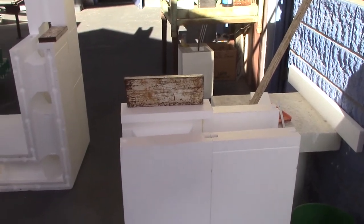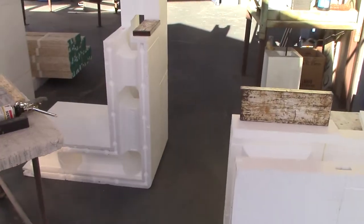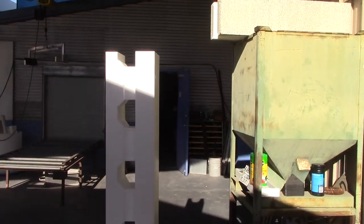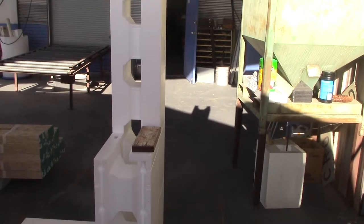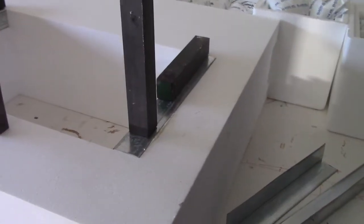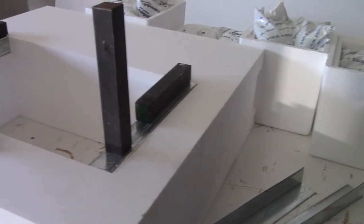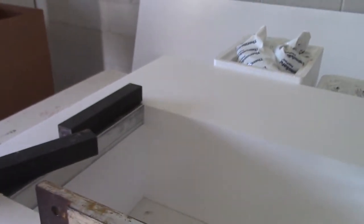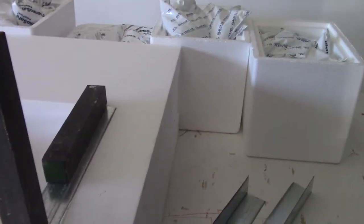Here's the last of the detailing, to put that hollow metal frame in. It seems confusing now, but it won't be, once I go pick up the door frame and put it in there. Here I'm taking that 3x3 piece at the end where the AC goes in and reinforcing it with a 2-inch by 2-inch 20 gauge angle. It doesn't look very exciting, but you'll see it when it all comes together. All this just takes a little bit of time, and half the battle is waiting for the adhesive to cure. But I got plenty of other things to do.